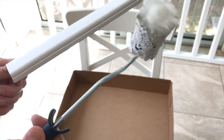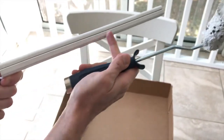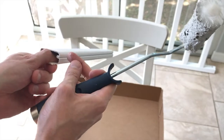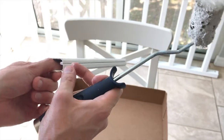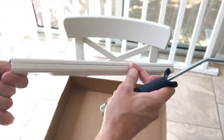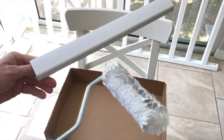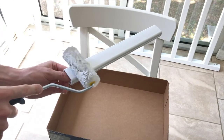We chose a roller, and we're using the same paint we used on our wall. We have the part in the closed configuration, because we don't want paint inside the groove — paint will get sticky, and if you open it later to add or remove cords, that paint will stick and may peel off the side. We are going to paint this before we insert and secure it to the wall, though you can also insert it first and paint it later. It's up to you.